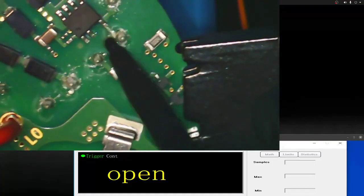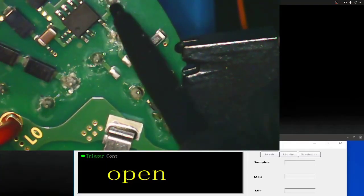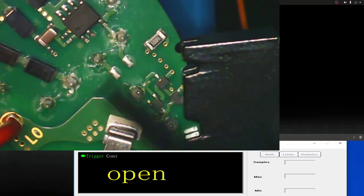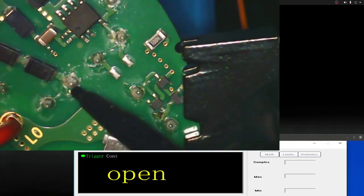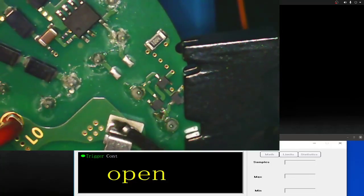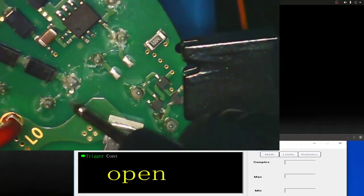And we can see here on the negative part of the switching MOSFET, it goes off into ground, which is there. So these will be tied in. The two negatives will be tied in. And that obviously, our switching power supply just taps into that leg there, and that goes off to our power in, or our 240 volt in. So I'm just going to get this on a 240 volt in pad. So obviously I've got the two probes there. Right, one on the pad in.